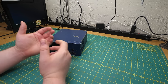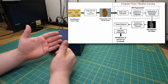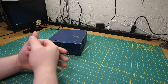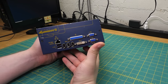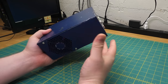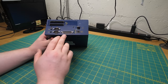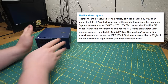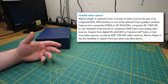Machine vision mostly comes down to feeding photos into a computer and having it draw factual conclusions from them. Some tasks require heavy-duty parallel processing — the industry was thrilled when CUDA came out — but in a lot of cases it's not that heavy a lift. Comparing two low-resolution 2D images just isn't that hard, especially if you're just looking for black spots. The Foresight 2 is from about 2001, and it's just an ordinary PC with no dedicated high-performance silicon — consumer-grade CPUs were getting pretty fast at that point. But you still need to get data into the computer, and you need a way to let it act on what it sees. Starting with the 44-pin connector — per the pamphlet, this port connects to a high-powered frame grabber called the Matrox Orion. Frame grabber is basically an industrial term for a capture card.